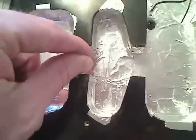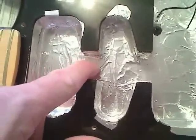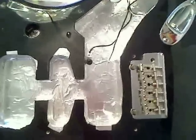And I don't mean bridge as in the bridge of the guitar, but this little gap here between the two pickups. I folded the tape over on top of itself to make sure that there was tape on both sides, so it's pressed against and then sealed across. I can't explain why it didn't work before — it looks like it should have — but now it does. So that's the value of checking it with a meter of some sort. Now I'll go back to the rest of my guitar build.